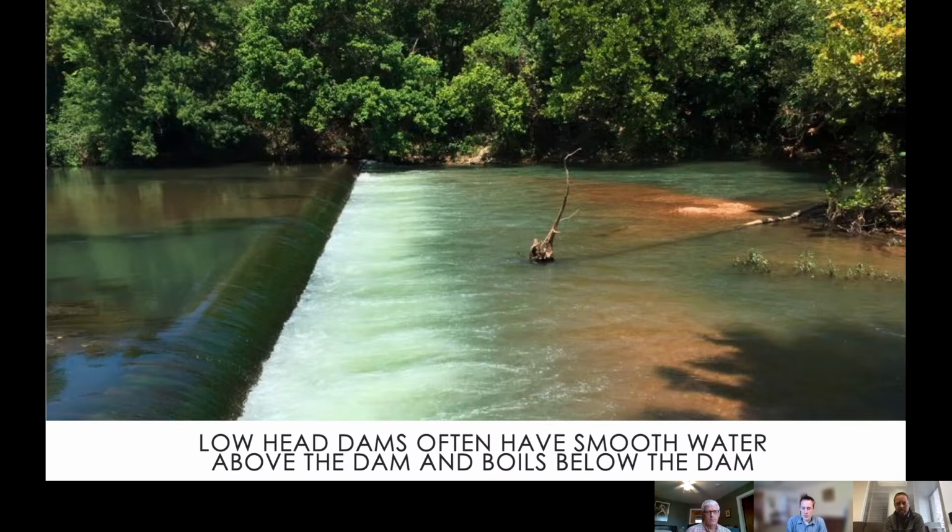You can see here that there's some sandbars and some trees that are present downstream from the dam. Those types of features tend to increase the water surface elevation of that tailwater. That increased tailwater elevation causes the hydraulic jump that forms to be submerged, and for that hydraulic jump to have a reverse roller, so it can have that entrapment potential. This is actually a Lowhead Dam where there were some fishermen on the downstream side who unfortunately were sucked into the Lowhead Dam from the downstream side.